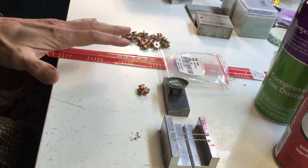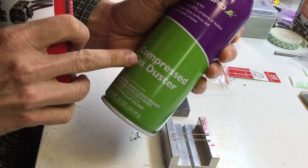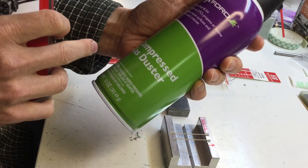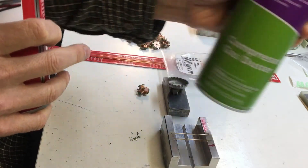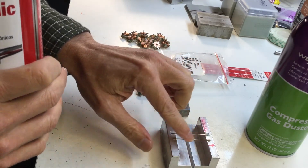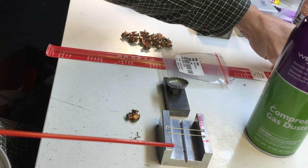I use those as balance weights — just glue them on with super glue. You also have to have a cleaner; this QD electronic cleaner works pretty good. And you need something to dust it off — this is a compressed air can, basically. You can get it at Walgreens or wherever; it's for scrapbooking and cleaning pictures. It's critical when using this balancing approach that everything has to be really clean — these rails and the armature shaft must be clean.